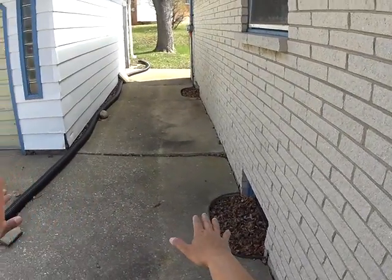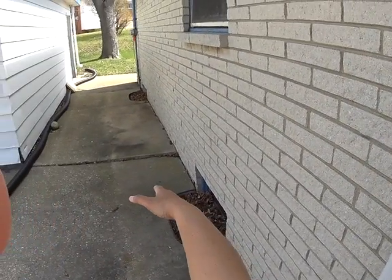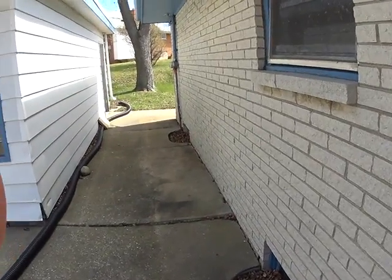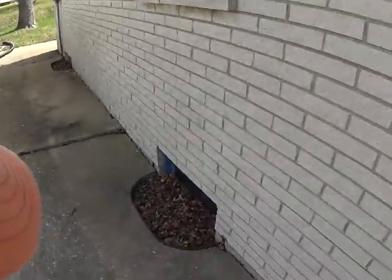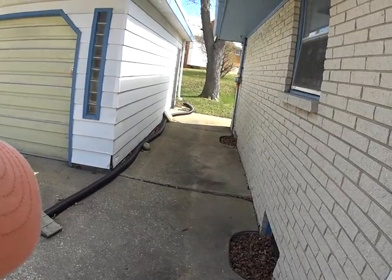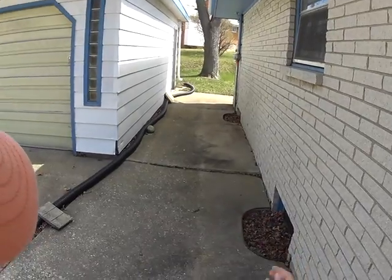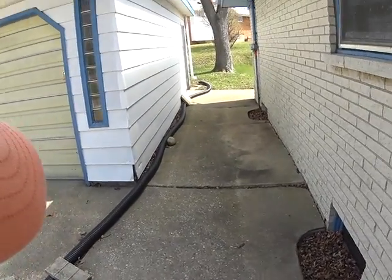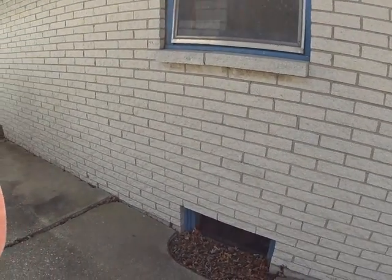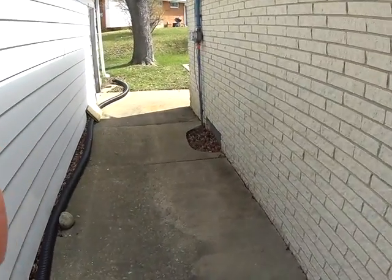If you see how this concrete actually bows towards the house, that means that they'll probably have some problems in the basement. So what we should do is to make sure that this is poured away. So what I would say is that this entire concrete piece, again, probably this piece as well, that we take it, whether it gets jacked up or we replace it or possibly repair, but the repairing would only be temp. So I'd highly recommend taking this concrete and getting it lifted, jacked up, or replaced, like cut out and replaced. These pieces are more than fine.